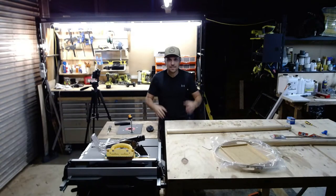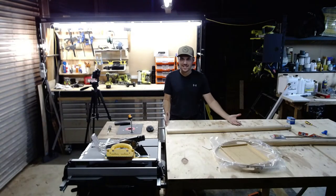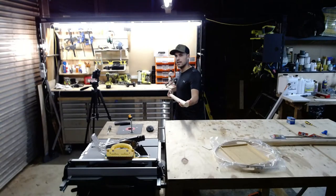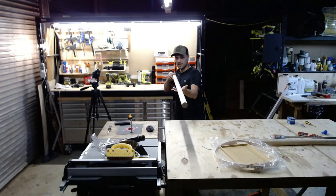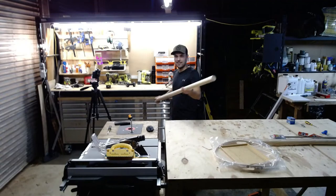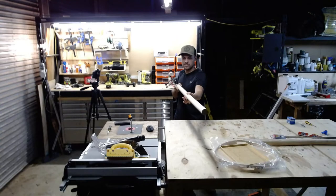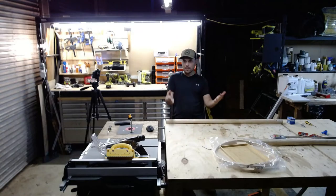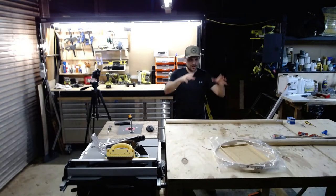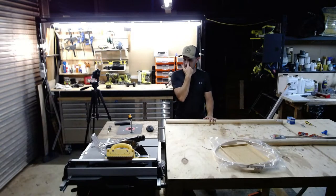So the first thing we do, I kind of do it right out of my head, is I'm gonna try to build a base with two of those rolls in the front and the back. Wow, this one is bent, I just realized that when I looked at the video. With two rolls in the front and the back, I don't really mind if it is bent, because this is only for the belt. So that's gonna be a base with a conveyor belt on the top that goes around, and then the top is gonna be like a steel tube. I'm gonna make that steel so it's 100% straight, with the sandpaper around it.